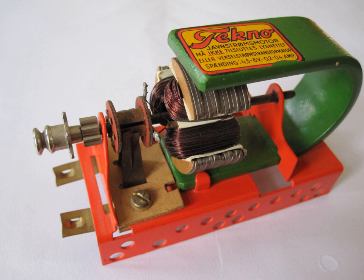The complexity of this system was that the armature must now be free to move up and down relative to the field as the suspension moves. With a contemporary four-pole motor, this would vary the pole gap at the upper and lower poles, probably to the extent that the armature hit the pole pieces. The solution was to return to the relatively antiquated bipolar motor. By placing the poles at the side of the armature and giving them flat vertical faces, the armature was free to move up and down between them. The motor design was relatively inefficient, even by the standards of the day, but these locomotives were designed for their power and haulage capacity with a generous supply of cheap hydroelectricity, rather than for efficiency.